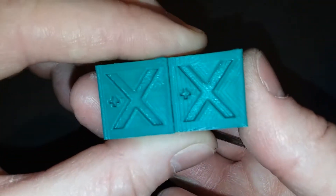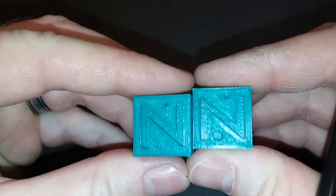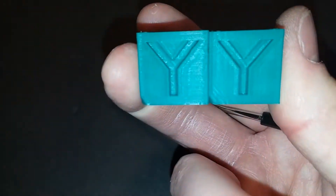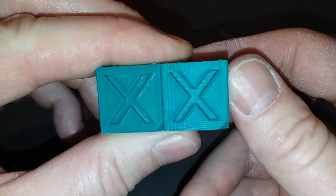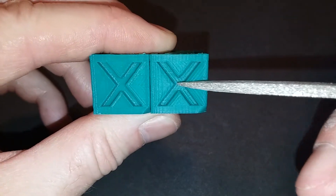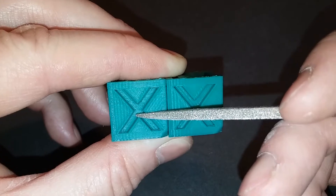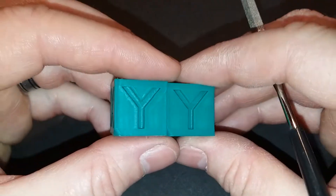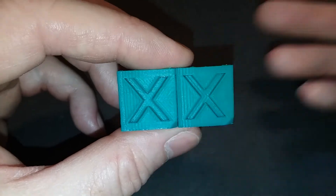This is a huge difference on this side. Here are the results of TL smoothers. This test is kind of to the extreme end of it, because I don't really know anyone who prints at 100 millimeters per second and gets a good print. Even with a metal frame, you're going to get this kind of banding. But with TL smoothers, it's significantly less. So if I'm printing at 50 or 60 millimeters per second, I can easily turn the acceleration up and maybe even get faster speeds. Do TL smoothers work? I would say yes.